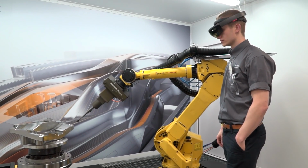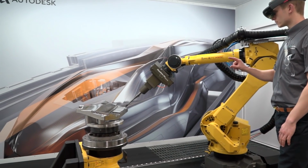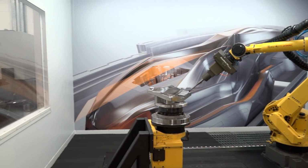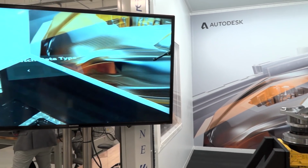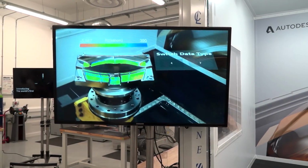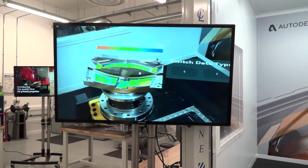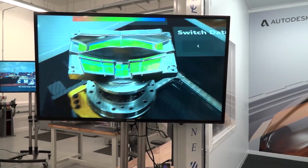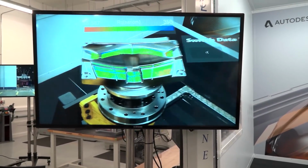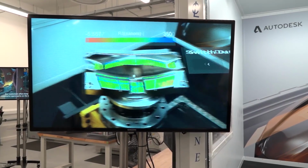Okay, so one of the activities that many people aren't aware of is the amount of polishing that still goes on in our industry. So a lot of tooling to get the required finish that's required. There are polishing processes. Today, those polishing processes are largely manual processes. People are in there with wet and dry, a whole series of other techniques to get the surface finish that they really want to get.